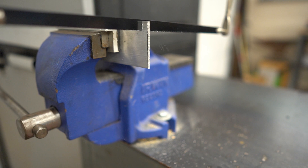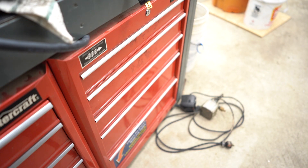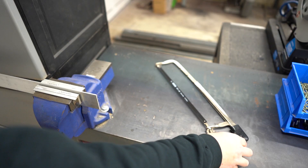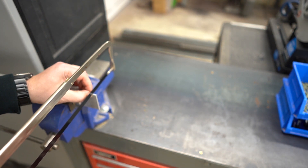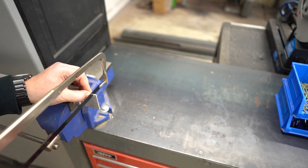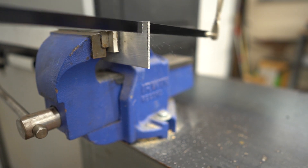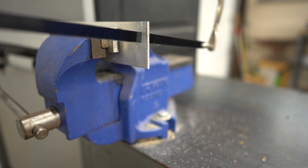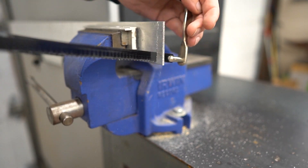You're not going to get very far in metalworking without mastering critical skill number four: cutting. Once again, we apply our foundational skills of measuring and workholding in order to cut. A lot of people dismiss the usefulness of a hacksaw, but a hacksaw and a bench vise combined can take you a long way. Often you'll have issues with the blade wandering. There's one critical lesson for hand tools — let the tool do the work. You don't need to put a whole bunch of downward pressure on a saw like this. Just move it back and forth with the weight of the saw and let it cut. If you try to muscle through it, you'll end up with a really crooked cut.